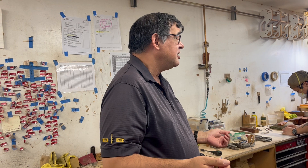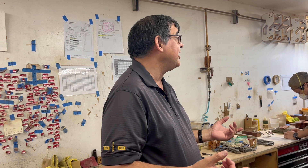The nuts and saddles were originally wood, but wood wears out really quickly. So they switched to plastic, which actually lasts a long time and is a pretty good nut and saddle material. But then people wanted something harder — bone is the big thing in the industry. So we switched over to Corian, like your countertop. If anybody's ever cut Corian, you know that smell — they were cutting nuts and saddles out of Corian and it filled this whole place. Then we found a company that makes a product called Tusq, which is a man-made material that simulates bone. Now we use Tusq.